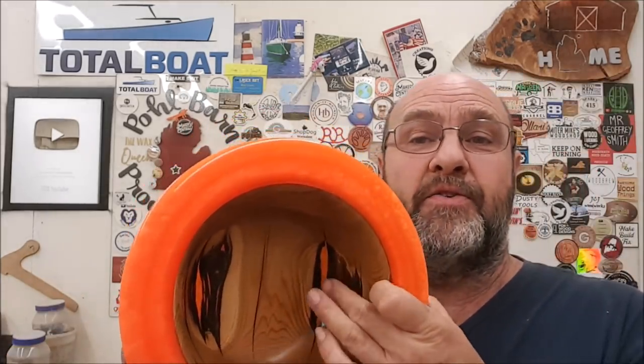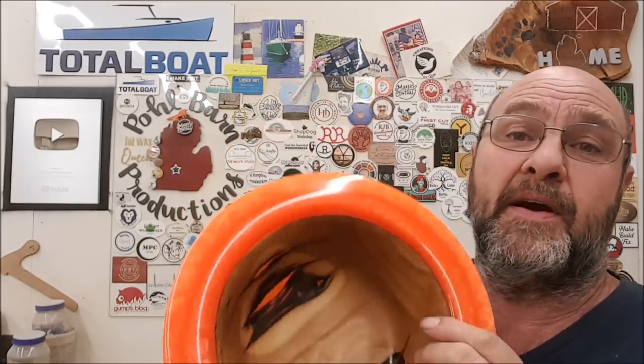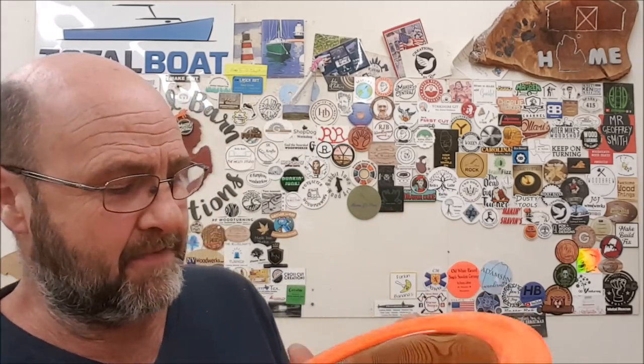I don't normally run into an issue where I can't turn the resin, because what I was getting was the bowl gouge was bouncing off of these, because it was so hard. So I had to go into the carbide cutters, which was scraper. So all it did is pretty much just, I mean, a lot of tear out that I ended up having to sand most of it out. The negative rake helped a lot, but it didn't get rid of all of it.